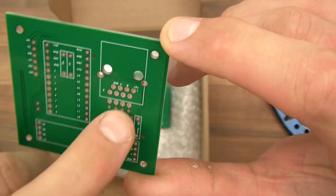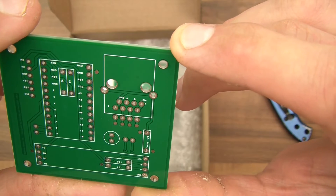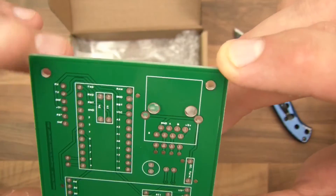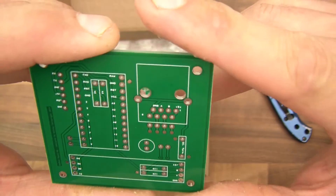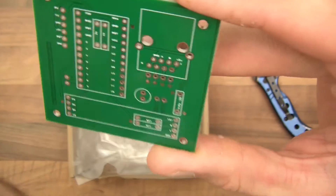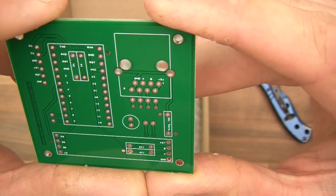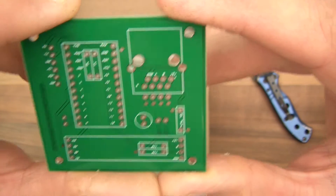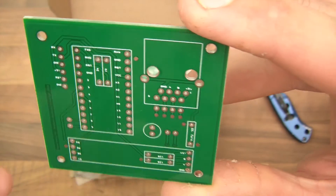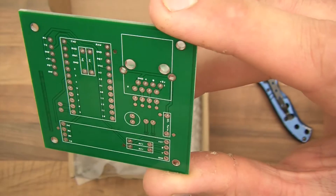I've got some spaces here for other things. This is a new thing — I don't know if it's going to fit, I hope it does — and it's for network connectivity. I want to be able to connect to the charge controller using RJ45. I haven't done the wiring fully because with RJ45 there are 8 pins and I don't know which of the 8 pins goes where at the moment, so I've just left it with test points — but ideally these need to be connected.